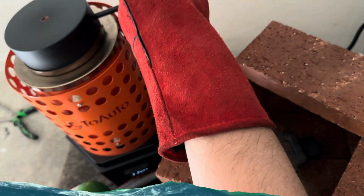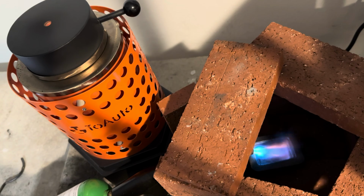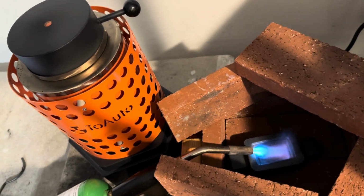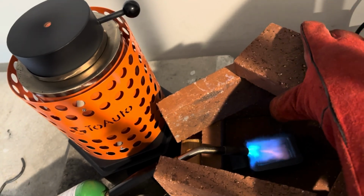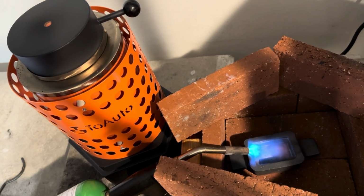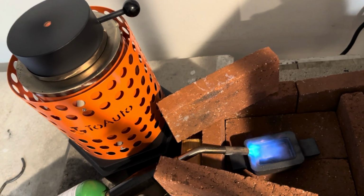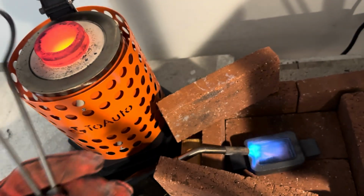Now for the pours. 3 copper bars, one after another. Now, copper is heavy. It moves fast. You don't get time to second guess your angles when pouring. The key here is confidence and consistency. My mold was hot, the metal was fluid, and gravity did the rest. Each pour went down smooth. No splashing, no voids, just a steady ribbon of liquid copper dropping into place.